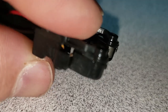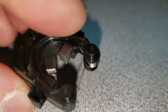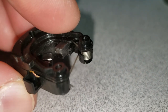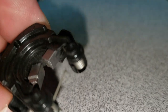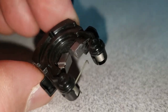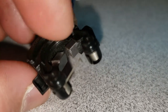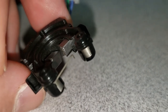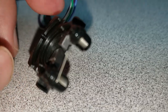Looking at the other brush — you can see the little braided wire going into the back of the brush, not uncommon. You can see a little bit where it's no longer a nice perfect circle — it's chipped a little. I want to see if I can't get this to ride a little smoother. I'm pretty confident if I put this thing back together right now the motor will probably run, as long as that brush maintains contact. But if it doesn't actually slide in its channel well, it will fail again.